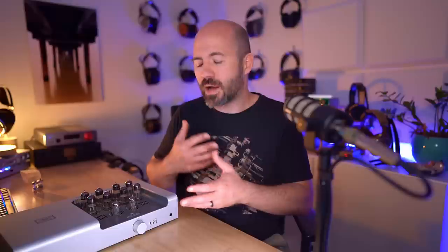After trying all three variants, I don't think I'd buy the straight 7062, but I can definitely see a reason why the 7062 pinched waist as an alternative to the 6N1P could be a good choice — particularly if you've got a headphone that needs extra body and weight, like an HD800. For me listening largely with the Atriums and Verite Opens, I didn't feel the need for that extra body — the 6N1P was just enough. But if I had HD800s, I could absolutely see myself wanting the pinched waist 7062. Do be aware of microphonics with the 7062s.